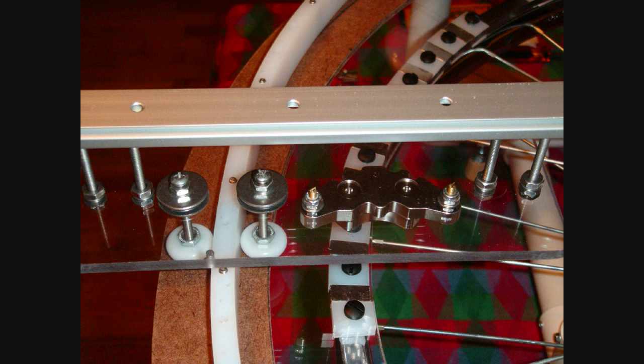I did like the way that the slider rail and carriage had performed, so I wanted to retain these elements, but reasoned that it would be best to move the stator magnet to a separate pivoting mount that could be actuated by the linear inward and outward carriage movements. My early videos demonstrated how the stator magnet could be pivoted using hand motions to achieve rotation and acceleration, so in keeping with that objective, I drew up a new, basic plan.